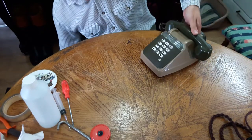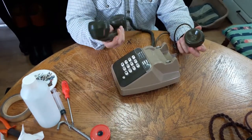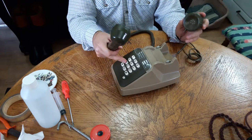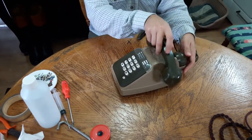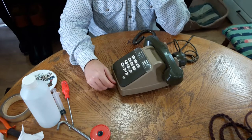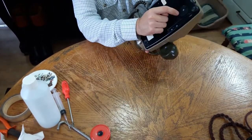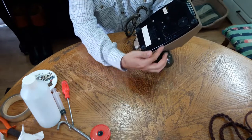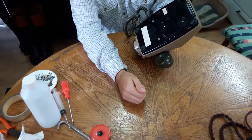This is a touch-tone French phone, which I thought would be worth showing. It has what they call an extra earpiece so you can be talking and somebody can listen on the other end — they call it a mother-in-law listening. On British phones this is called the watch receiver, because it looks a bit like a pocket watch. This French touch-tone still rings on bells, uses tone dialing, and has a hash, star key, and recall button. It has a volume control for the bell, and my friend who converted it cleverly fitted a bell on/off switch — just a little slider underneath — so you can actually turn the bell off.